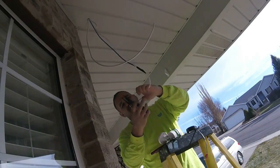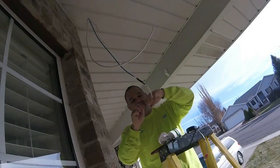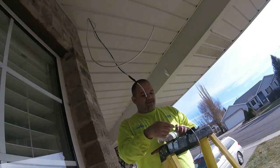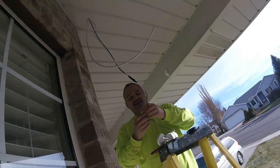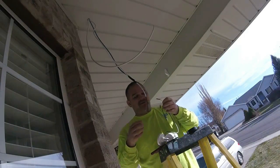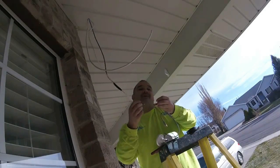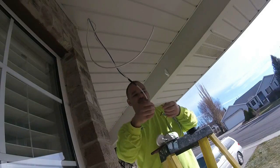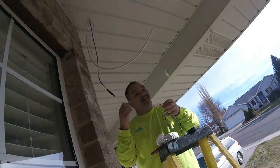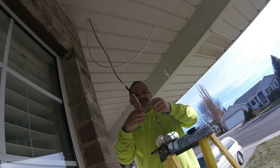I only have to strip about a quarter inch. I do know some of you guys are watching and hate the idea that I'm cutting off connectors and splicing — I know that's going to void the warranty on the camera. But the warranty is already voided; I've had these for about two years. They also make adapters where you strip the wire and screw it in, but I don't have them and besides, the adapter might come unplugged up in the ceiling, which is more of a problem. If I put a permanent connection on here, it's never going to have a problem — if there's no power to my camera I'll know it's not because the connection came undone. So I'm going to go red to red.